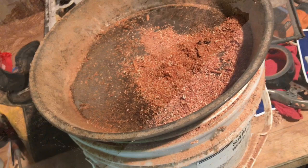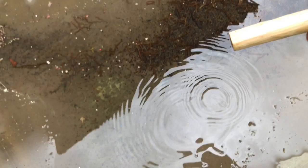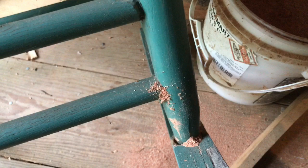It's been raining out here today, and I'm going to get this dowel wet. I don't have running water in my shop, so I'm just going to get the dowel in this dirty old water here. Some of this water in there will make it slide a little better and help activate the glue from what I understand. I'm not worried about the water being dirty — it's going into wood, and wood is not one of the cleanest things you'll deal with in a day's time.